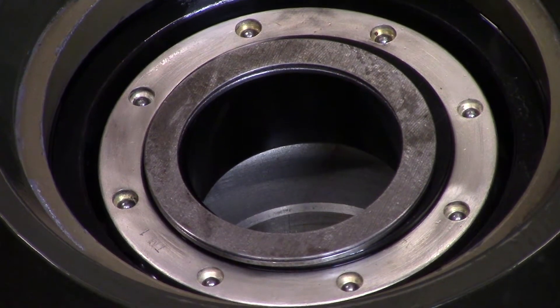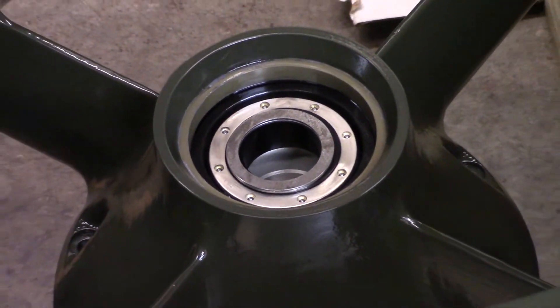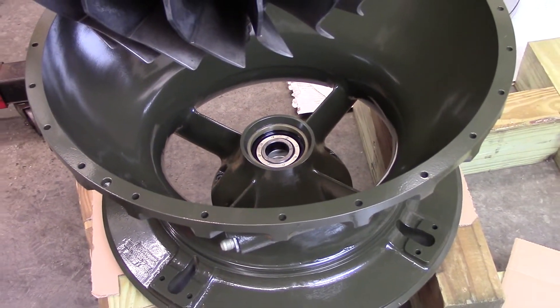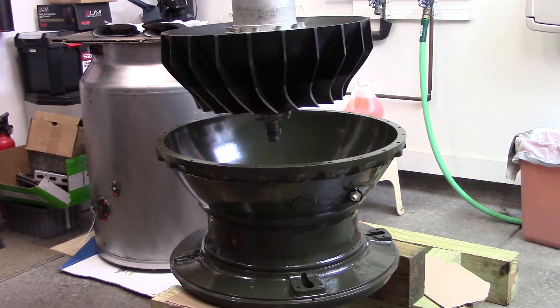We have our spacers installed. There are two spacers — the total thickness is about sixty thousandths of an inch. I recorded that so I'll know which way to go depending on how far off the clearances are. You don't want to pull the shaft back out to change the shim more than once. Now we're ready to drop this rotor assembly down into place.